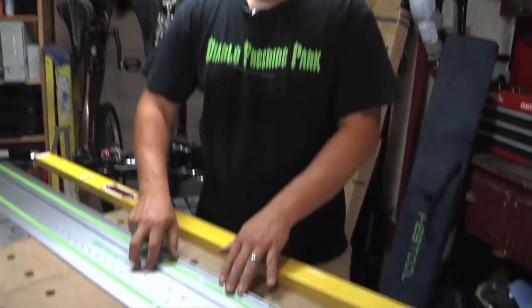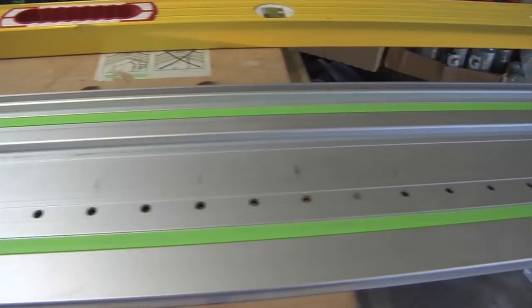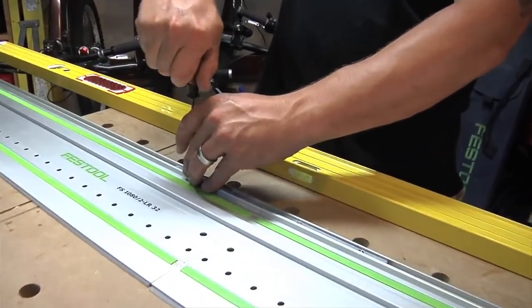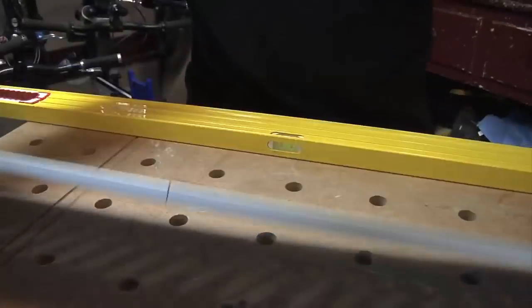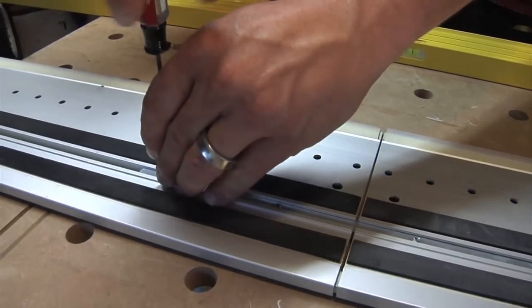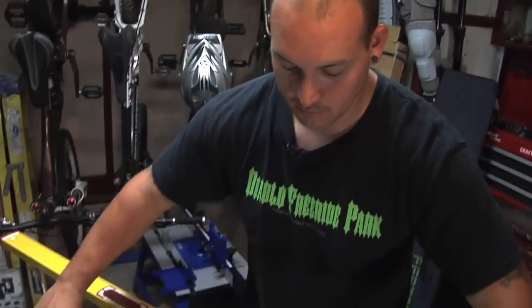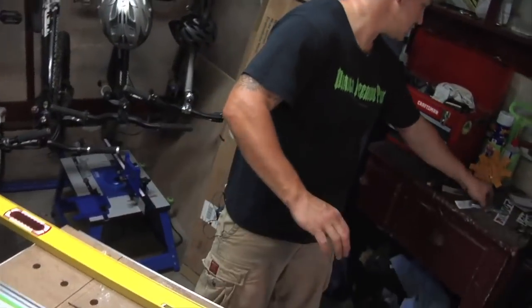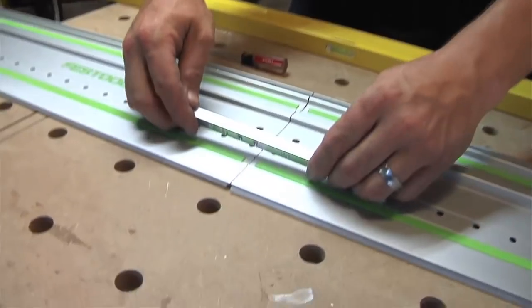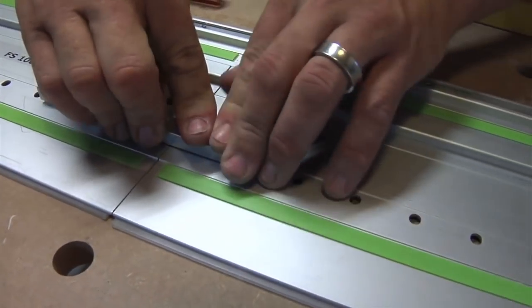Now we're going to do the same thing, only this time we're going to space these so that I can use my holes for the LR32 hole drilling kit mounted with the router. I'm going to loosen all four of them. Flip it over, loosen up this side. I always find I loosen them all — it's better safe than sorry. Sometimes if you just loosen two, you can end up kinking it. This way everything can move nice and independently of each other. You're going to use the LR32 connector and what you're going to do is fit two of them to these holes and it'll space your rail really nicely — fits in there really snug.